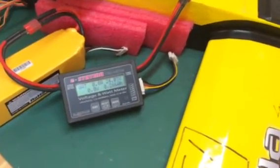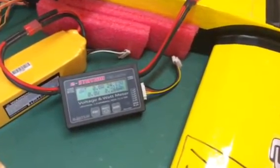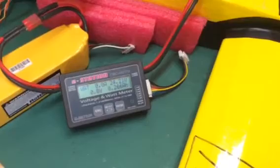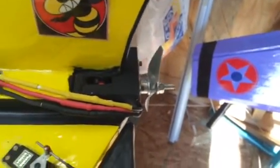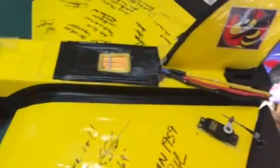Okay, not bad. I saw right around 1,620 watts and about 75 to 80 amps. Motor's turning a 7.5 APC through a 100 amp ESC. I think we're going to be okay. Looks like it's going to run real good.